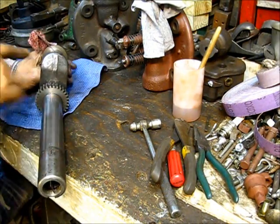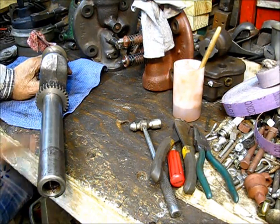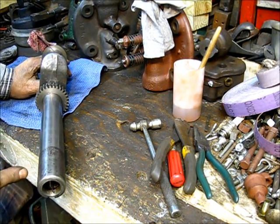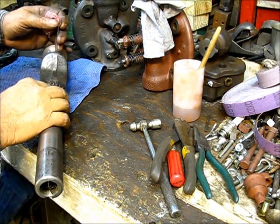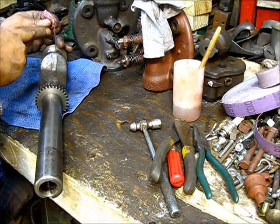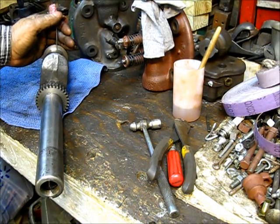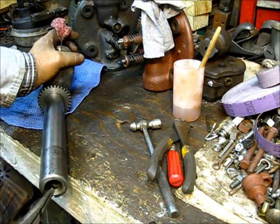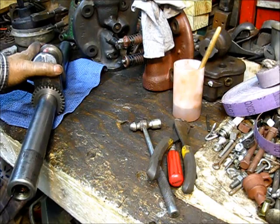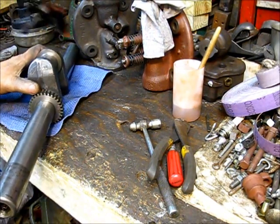But first, we got to get this grease hole in the center of this crankshaft cleaned out really good. And you see, I got that piece of baling wire run through yonder, and then I got it bent over there, and a piece of cloth there that's been soaked in some lacquer thinner. And we got to bring that through there several times to get that old junk grease out of there. And you see that we get it in there and get it started and pull that through there. Y'all see that?